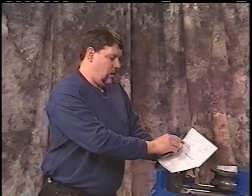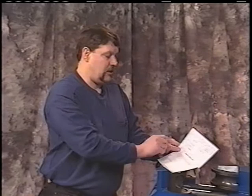We'd want to put the vehicle make in here. We'd want to put the diameter tubing in here, the year of the vehicle. We'd want to put the application. We'd want to use the information down below. If we used a 4-inch radius die, if we used a half shoe, we'd want to note it just like you would on a factory card with a star. If you saw cut the rear to suit appearance, you want to make sure and write that on the card.